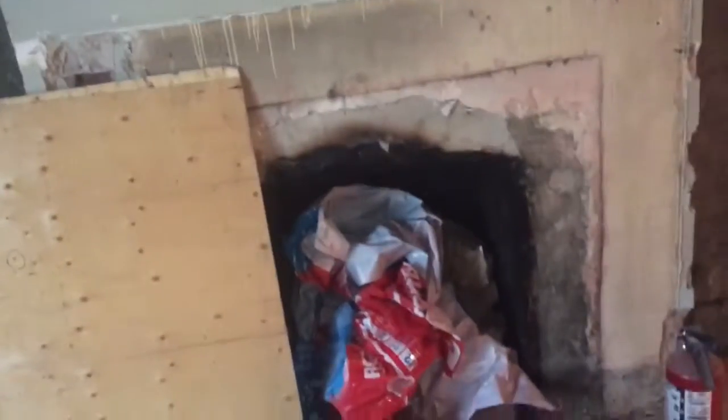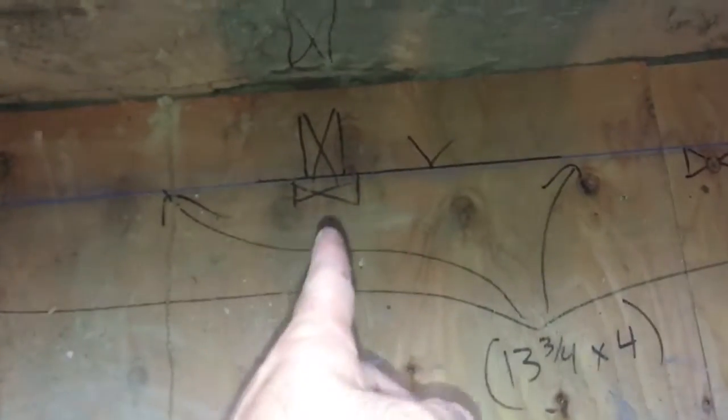And again, I just haven't marked it out because there's no need to at this moment, because we're not going to be setting up. It didn't affect anything at the moment, but I just want to try and get this laid out because when we're putting in our new studs, I want to make sure that we have a stud behind a central panel where we have a piece of mullion, so that when we bring a 4x8 sheet of 1/2 inch MDF across, we can cut it off underneath one of these trim pieces and hide that seam so that we don't have a full 8-foot piece ending in the middle of nowhere. We cut it back to the right size so it's hidden underneath one of these little 2.5 inch pieces of trim.